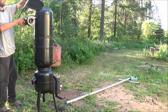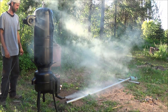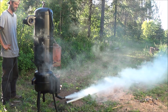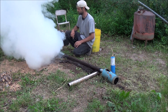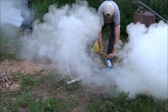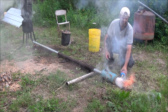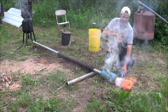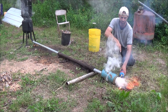Let's go ahead and lift up the lid and turn on the fan. Let's see if it lights nice and easy. You can see the smoke is coming out nicely — it's not dying down. I'm starting to see a little phase shift in the smoke, so we're going to try a light-up here. I'm going to stick this pipe right up over that, come down here, light the torch, and watch the smoke disappear. There you go, folks — there is wood gas burning, as long as I can keep this pipe cool enough. With a very short radiator, it's going to be a little difficult to keep it cool enough, but there's the wood gas burning.